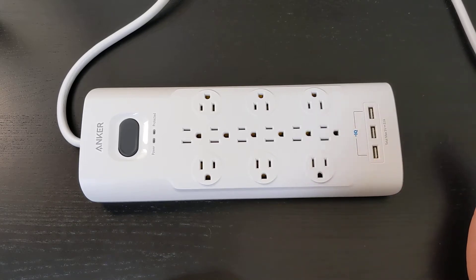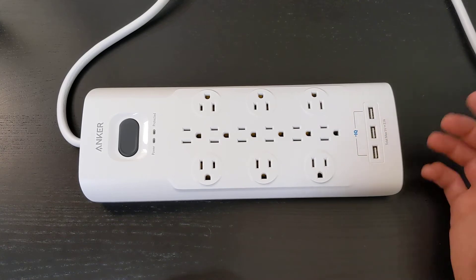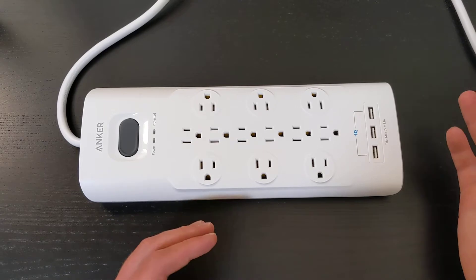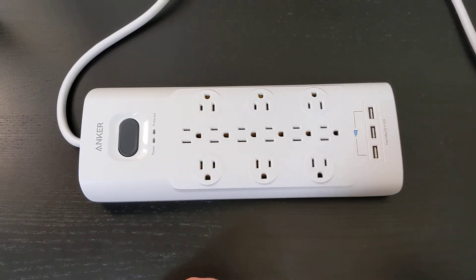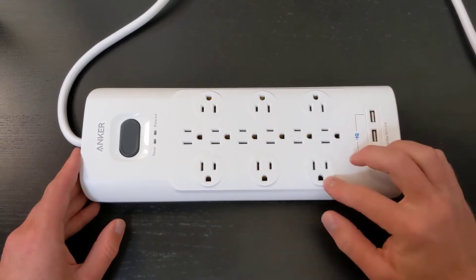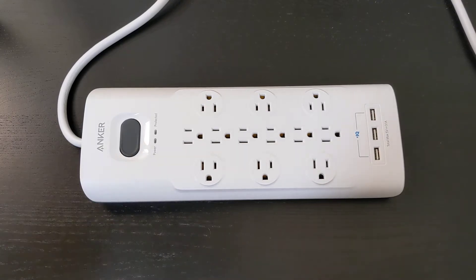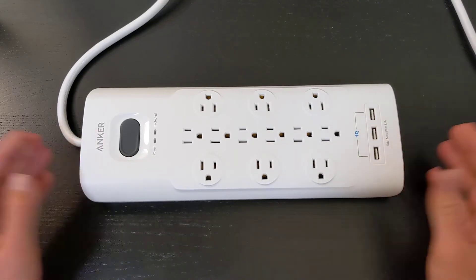It's nice that it's a surge protector. That wasn't super critical to me. We're in California, so there's not thunderstorms very often. There could be little blips in the power lines, but it's not too concerning, especially because basically all of our devices have their own protection at the input on the AC side. They all have low voltage DC regulators inside them. They could be damaged by a surge, but they're not as delicate as things used to be. This one is rated to 500 volts — that's 500 volts between each pair of lines: line and neutral, line and ground, and neutral and ground. That means it has three sets of surge protectors in it, and I've never had one of these apart, so it's interesting to see how they work.